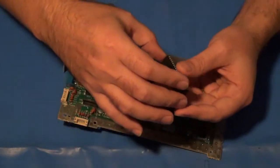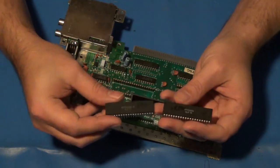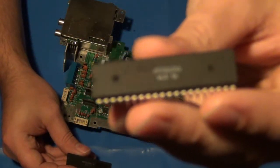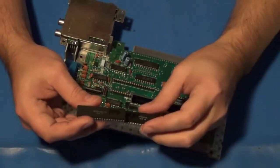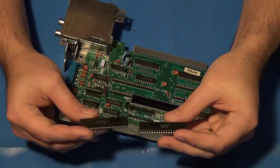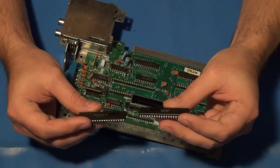When you take the processors and separate them and take them off the boards, make sure that you note which one is which, because they are the same size chip and they're very similarly labeled. So it's very important that when you remove these, you notate them, put them off to the side, or actually do what I did and use a Sharpie to write on there which one's which. Additionally, the second part of this lesson is don't believe everything online. I took the chips off, wasn't sure exactly which one was which, so I thought I was being smart, and I Googled the chip numbers and found what looked like a pretty reliable source, because it was giving me all the Ricoh specs of the chips, and these are Ricoh made chips.